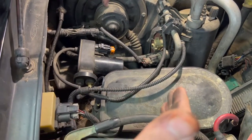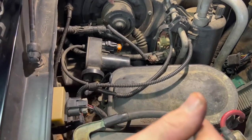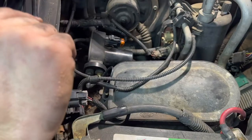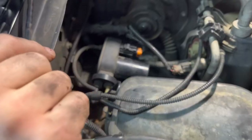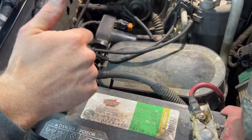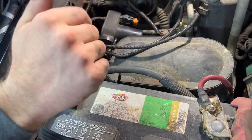The pump is trying to achieve vacuum. Now we're going to see if we have a line leaking — whether it's something in the dash for the HVAC controls, the heater control, a leak in our canister, or a leak going to the four-wheel drive solenoid.